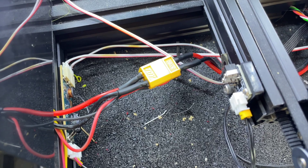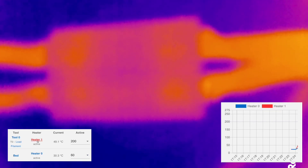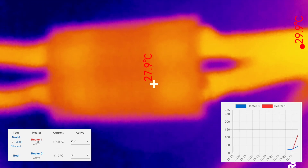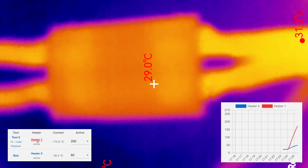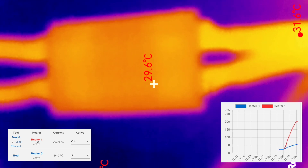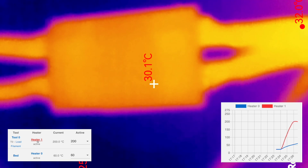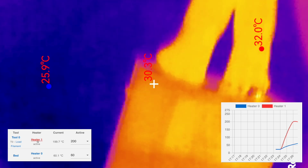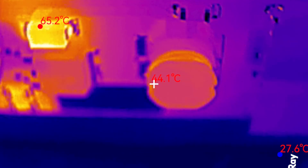Let's see if our new connector actually works. I'm running the same experiment as before - heating the hotend to 200 and the bed to 60. Well that's looking much better. I run it up so that everything is fully heated and we've only gone up to about 30 degrees. I'm thinking it might be worth upgrading the cables to something a bit better - I'm not sure the current cables are actually copper so we're probably losing a bit of power.